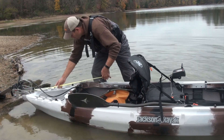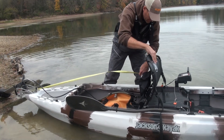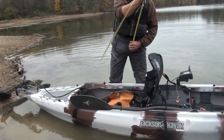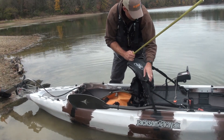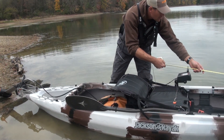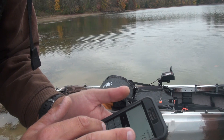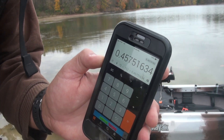Let's start with a good average measurement. We're measuring from the stern to the rear of the seat pan. That's at 70 inches. I'll get the full boat length in a minute, and that'll give us our seat ratio percentage. I'll move it to other positions and see which one gets the best top-end speed. So 70 divided by 153 — we're at about 45 to 46%. Let's give that a shot and see what happens.